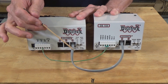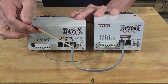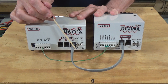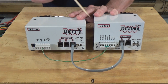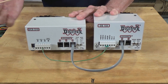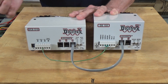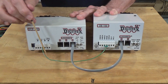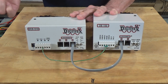The first thing you want to notice is I've got this standard 6-wire LocoNet cable — I've shown you how to make those in previous videos — and as you can see they are just daisy chained from the command station to the booster. The reason you need this is it transmits the DCC signal from the command station to the booster, which then boosts it to the voltage and amperage you want for your track and sends it out. I've eliminated the power connections and track connections in this setup to make it easier to see what I'm doing.